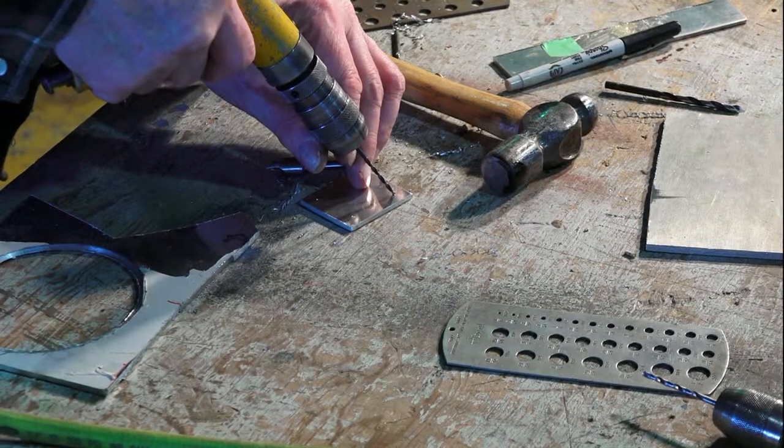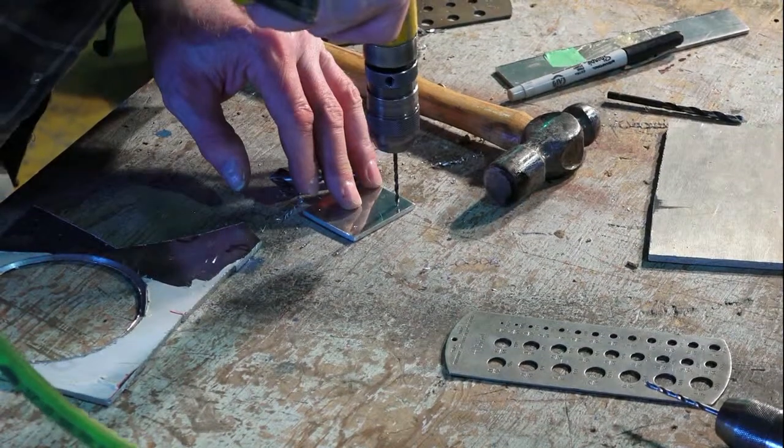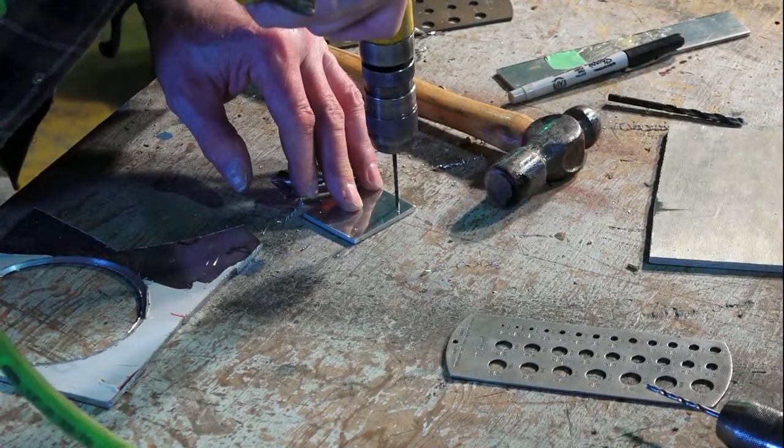Once you've got them down here, there's your dimension: 1.136 to 1.146. So what I'm doing is setting up roughly halfway between those two numbers — about 1.141 — giving myself a little bit of fudge room.